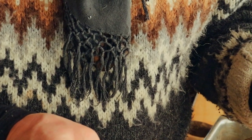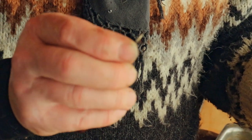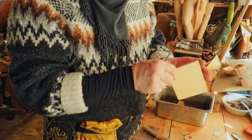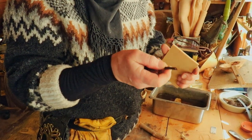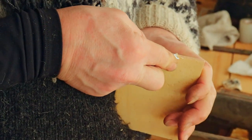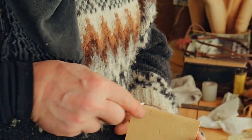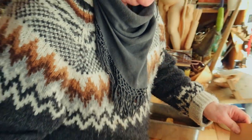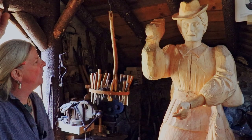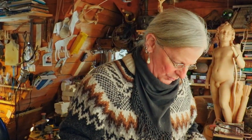This one has the edge at an angle — that's called a skew. If the grain of your board is going this way and you wanted to cut across the grain, a skew cuts it nicely because it slices like a slashing knife motion instead of pushing straight in with a chisel. It has its purpose there, and I have a great big skew that I like to use for planing down or planishing a surface. Even working on a face, I use this big skew to smooth the surface and take the gouge marks out.